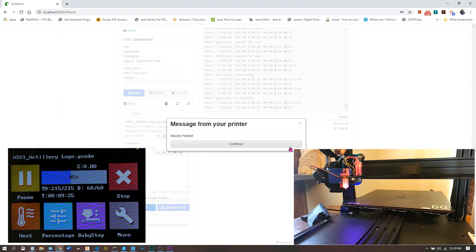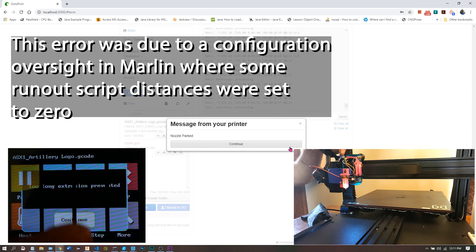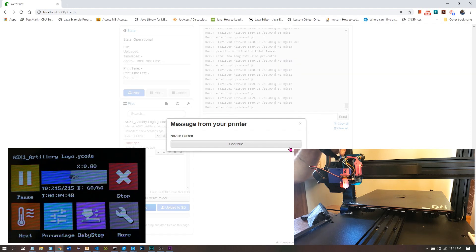One has to take priority and the other has to keep quiet. I haven't done deep research to figure out whether all of that comes in through the same serial port because of the board or because of how Marlin handles inputs. But I did read from one source that it was a hardware issue where the port used by the TFT is physically the same input as the USB port that Octoprint hooks into. There has also been talk about Marlin supporting multiple serial inputs at the same time, either now or in the future — I have to do some research on that.